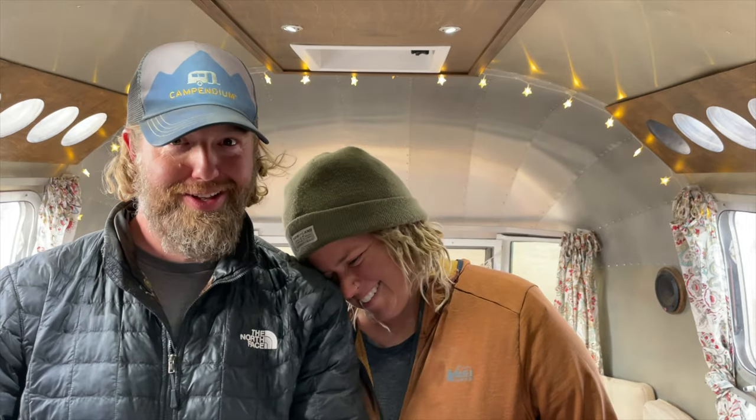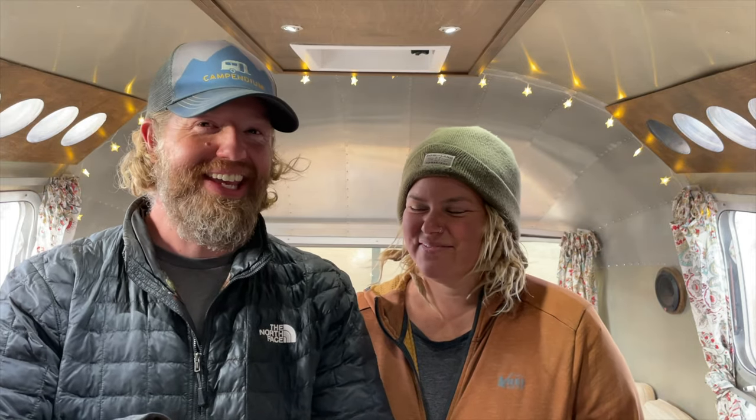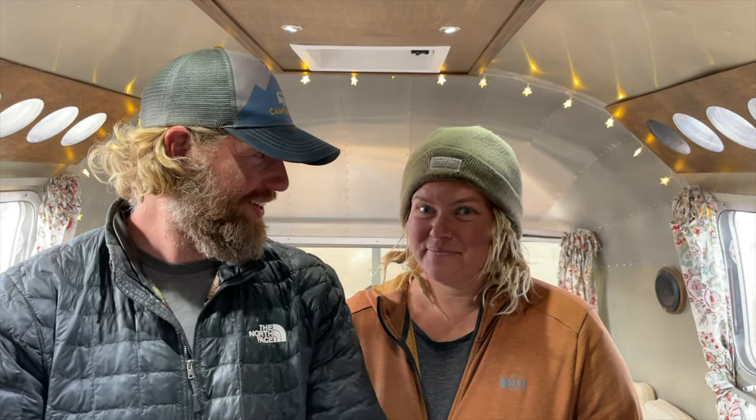To wrap up the day, we were at 18 inches, so we put all our electrical boxes right at that height, which is pretty standard. It's a little bit high, but pretty standard. And then we went up to the next level. Our bags are about 5 inches, so we're at 23 inches, course 5. And we will see you tomorrow.